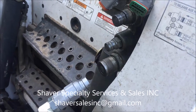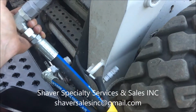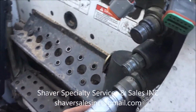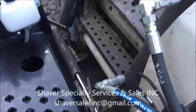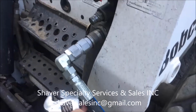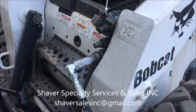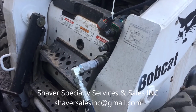What I like to do with these, like these just come screwed on from the factory, all three ends, and they're never on the right angle for any given machine. So what I like to do is get them up, get them in there the first time. You do have to fight it just a little bit, but if you can take a wrench and loosen this fitting and then just kind of bounce the hoses and just let them find their neutral happy place, it's going to save you a lot of time, hassle, and frustration moving on every time you take the couplers on and off.